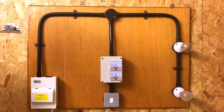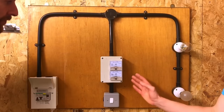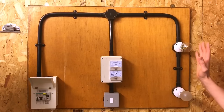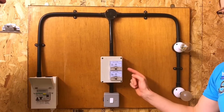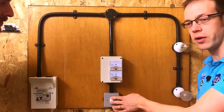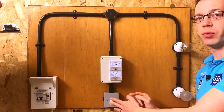Let's get this circuit live. We'll turn the RCD on and just turn on the coil circuit breaker for now. What we should have is a situation where we can energize the coil, but because we've not got the lighting circuit turned on, the contacts will pull in and out but the loads won't operate. If we operate the switch we should hear the contactor pulling in and out - listen for the clunk. That clunk is actually the contactor pulling in inside there.